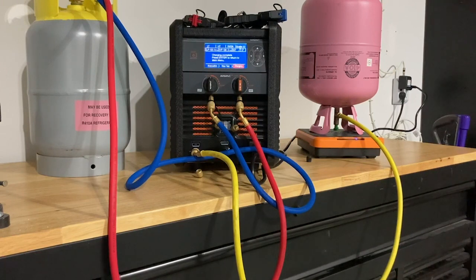This is like having an extra technician on the job. It does come with Bluetooth superheat and subcool sensors — you can pair those up and get readings off your equipment once it's running, just like you would with a digital manifold. When you look at the price at your local wholesale distributor supply house, consider what it costs to purchase a digital manifold, a 6 CFM pump, and a refrigerant scale. You'll find that this is more affordable, and it also does the job for you.